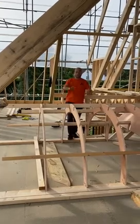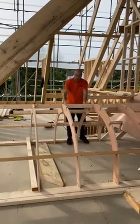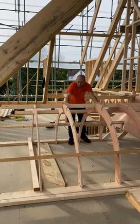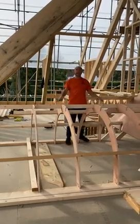Good work tips on curved dormers. There's a few ways people do this. They cut the notches in between the ply. You get a lot of people that put the timber on the top of the ply. I like to cut notches in and sit that in.